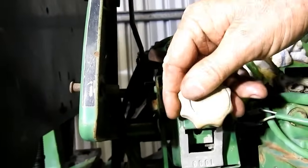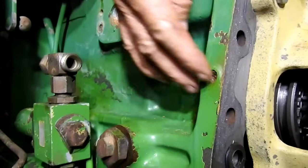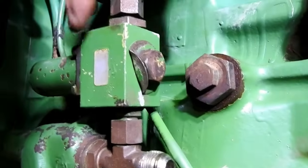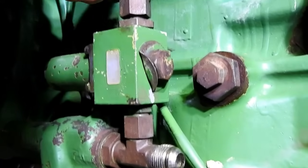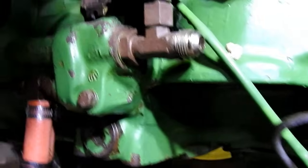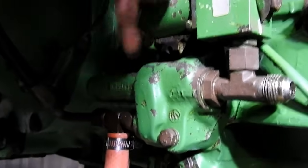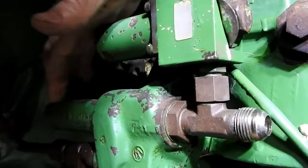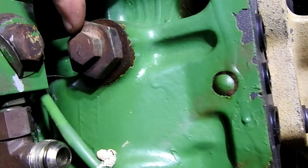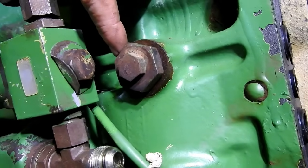Down the side of the tractor, to get things in perspective: there's your hydraulic lever, this is your right-hand mud guard as you sit on the seat. Come down under your lever - on this tractor that's your PTO speed. Keep coming down, you'll have a foot plate comes through here. Under your foot plate on the right-hand side you'll see this valve here. This valve is only on the hydrostatic steering tractors, so if you haven't got the big solid black steering column like we did a video on in the 2030, you won't have this. But all tractors will have this - this is your steering priority valve, which lets pressure up into your steering when you need it. But we're here to talk about this valve here - it's our filter bypass valve.